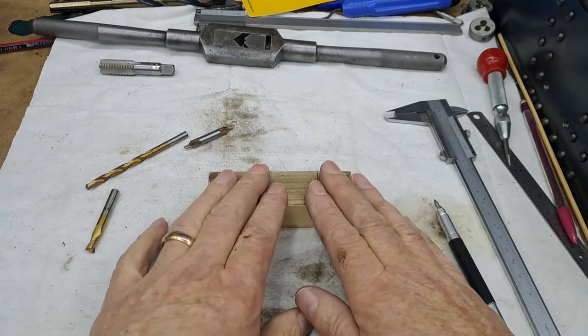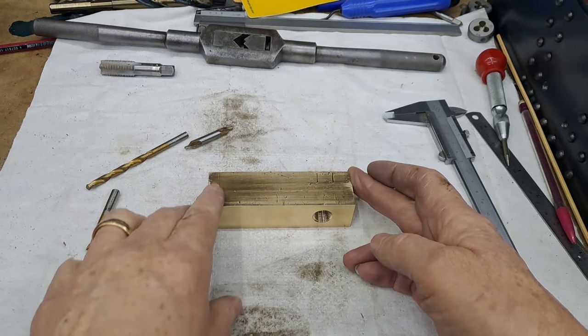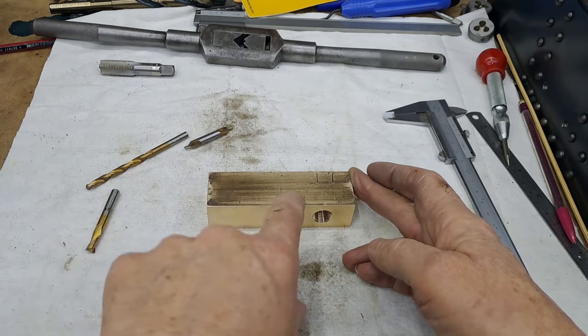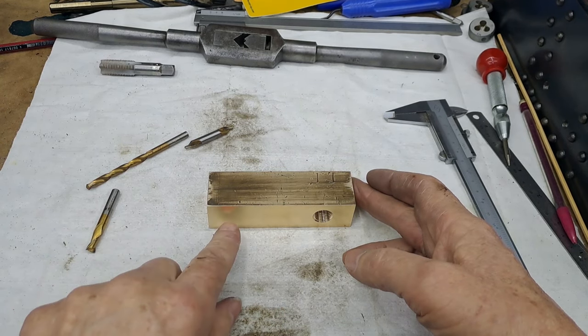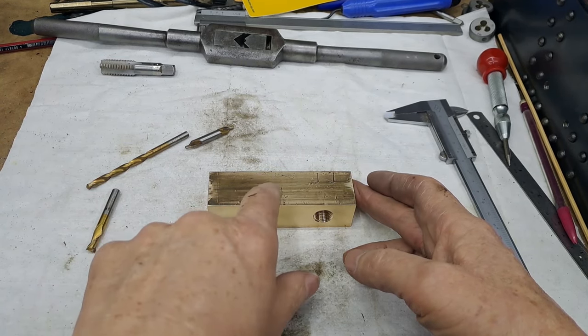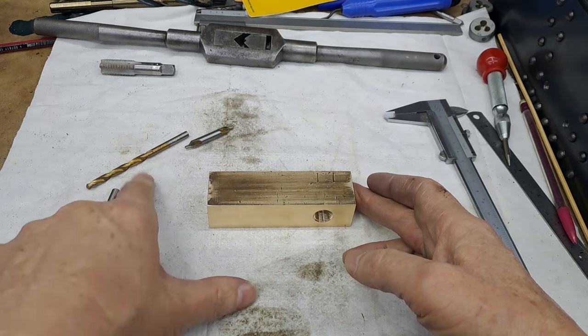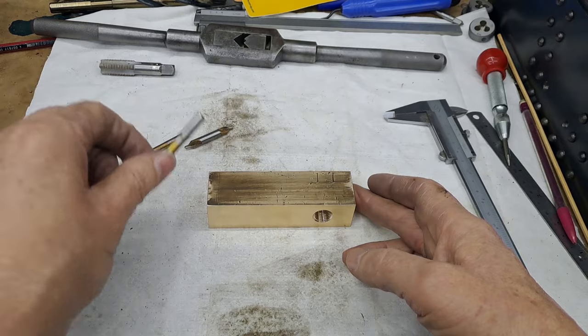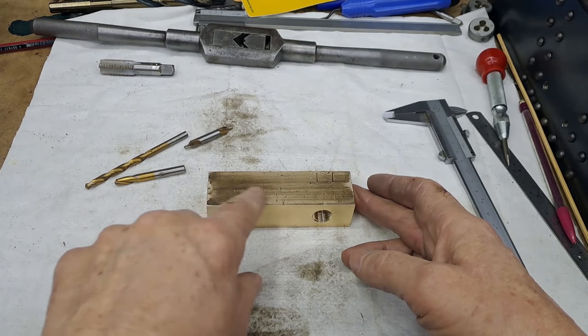Right, guys, going into the vise, set it up again with the zeros on the corners, work it out, come back, do the 6.5 with a center drill and the 5mm, go down 8, then come back 22, go down, center drill, 5mm, and then I'll get this mounted up in a collet chuck, and we'll start making a slot.